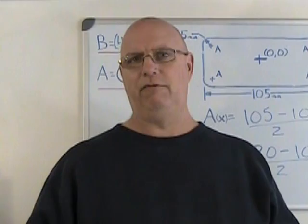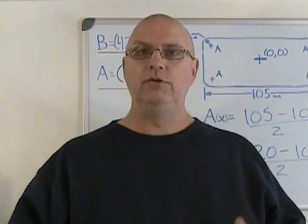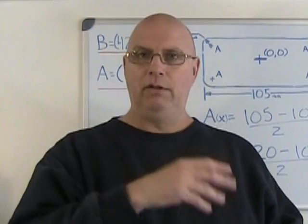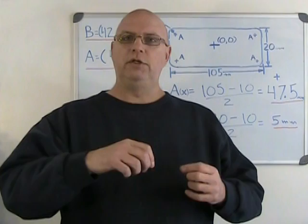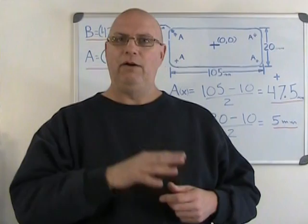Another thing that's good to mention here that's different from what we're used to doing at the start of our careers is that pocket milling creates a pocket, a place where the chips can accumulate. So when pocket milling, you're going to want to use a strong jet of coolant to empty out the chips as they're being made. If they stay in the pocket, the tool is just going to remash them, and it's going to affect your finish and obviously your tool life.